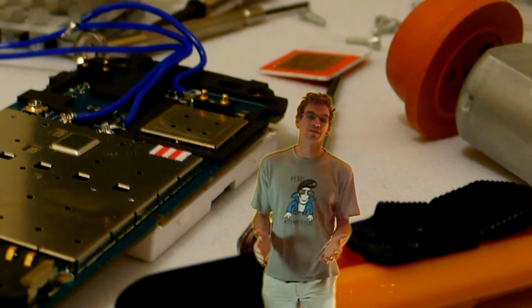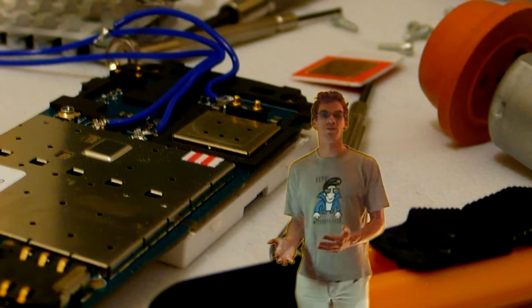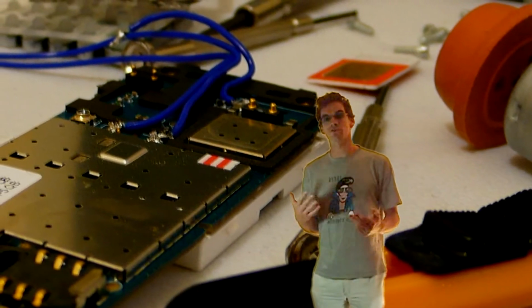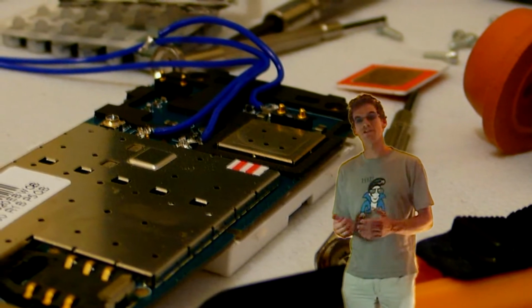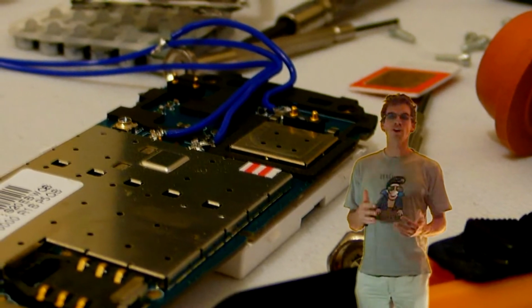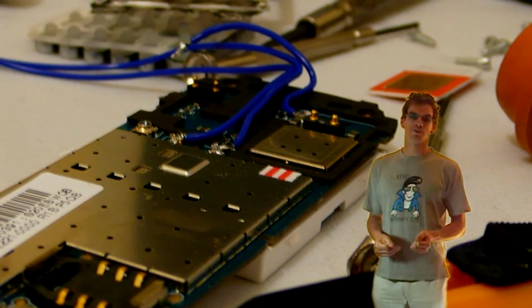This is where the multimeter comes in. With minimal probing, we need to find out which line goes to the power and which line is the signal. Once we know this, we know which is positive, which is negative, and therefore whether we need an NPN transistor or a PNP transistor. It's not going to break anything to get it wrong, but if you do get it wrong, you're not going to get the behaviour you want.